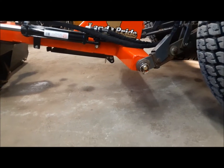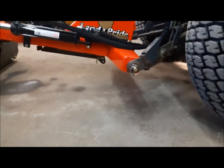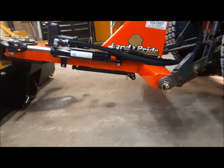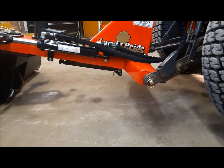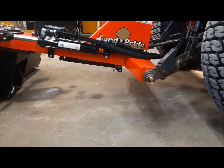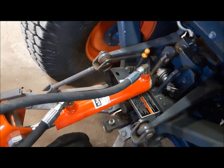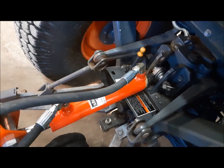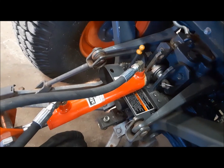I left this thing overnight. When I came out this morning, I found it like this — so we're definitely suffering from a bit of creep in the directional control valve. I'm going to have to go ahead and put a double pilot operated check valve on this cylinder. I have one, but it's got half-inch ports and it's really big. So I'm going to go out and grab one with three-eighths ports and a couple of fittings.